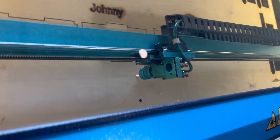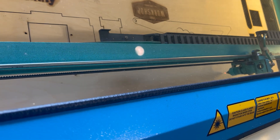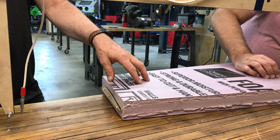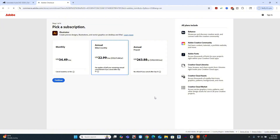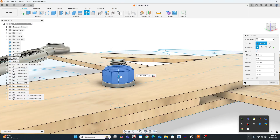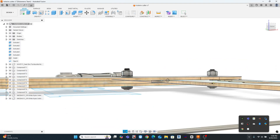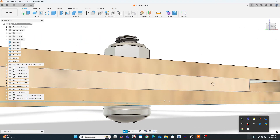This way you can take the files, cut them in plywood, and assemble your own. The sketches are really all you need for a laser cut project — that means you could use just about any software that can export a vector-type graphic like DWG or DXF file. The beauty of continuing on to 3D model the part, though, allows you to assemble and see exactly what fits and what doesn't. You can take measurements and experiment with different things like hardware.